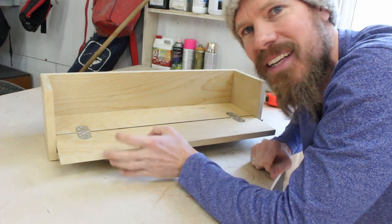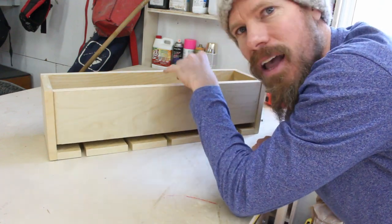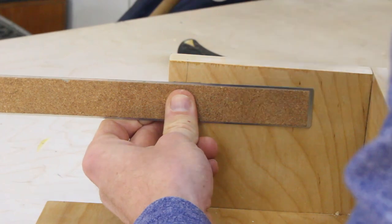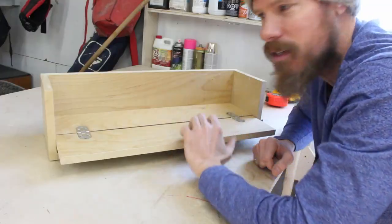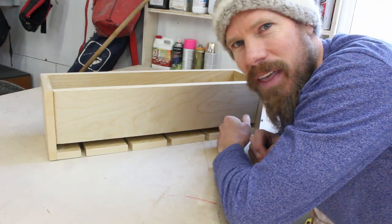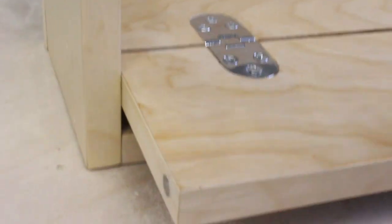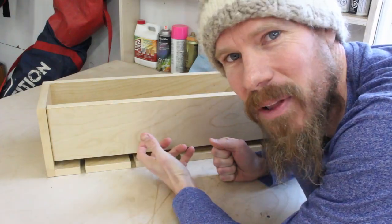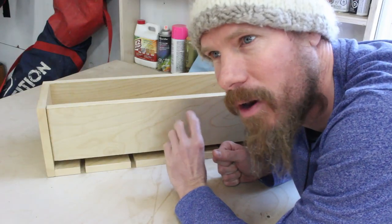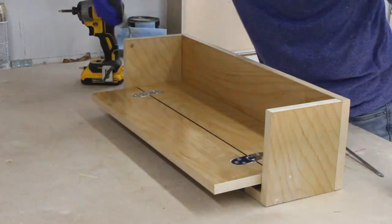It's together and it looks pretty darn good. You have the wine bottles here, put your wine glasses up on there, pour your wine. I was thinking it would be really cool to put a little magnet right here and maybe another one here so that just holds the door into place — kind of a detent that clicks in. You could also put a stop on either side. The door will stay on its own; there's enough friction in those hinges to keep the door up. I really like how that worked out — I've got a magnet on this side and a magnet here, so when the door goes up and finds that magnet, it just sits there like a little latch. The only thing left to do is the final finishing: fill those nail holes with wood filler, sand the entire thing lightly with 220-grit sandpaper, then one more coat of finish. Then take some really nice pictures and throw it up on Etsy to get your YOLO back.